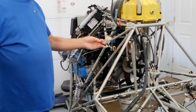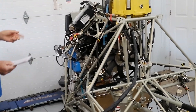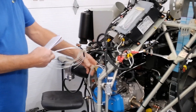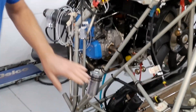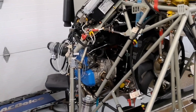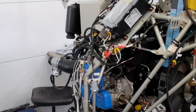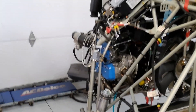There are some harnesses here — this is for the fuel tank gauges. The fuel pump: what I want to clear up is that these white wires are my wires that I'm adding. The fuel pump controls are labeled A and B, but the fuel pumps themselves down here are labeled one and two. I did some research and found a document by Rotax that says when your wires are labeled A or B, A is going to be number one fuel pump and B is going to be number two fuel pump. When I'm wiring it myself, I will label the wires correctly so anybody working on it in the future will know exactly where they're going.